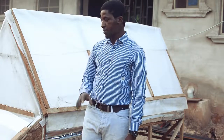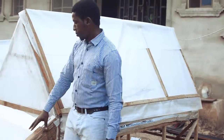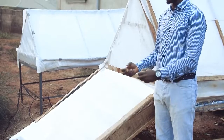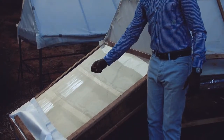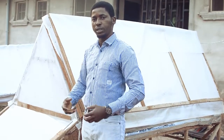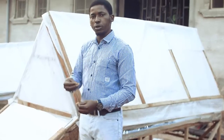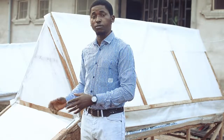Considering those three factors, I made this design. First, for getting good temperature, I made this solar collector — a heat collector. This is a transparent glass, and inside the glass there is a black aluminum sheet. The black color absorbs the solar heat and traps it so that the air flowing through will be dry and warm. When it gets into the dryer, there will be an increase of temperature, causing the moisture inside the product to evaporate. If there is no evaporation of moisture inside the material, there won't be drying — moisture will be entrapped and spoilage will happen.